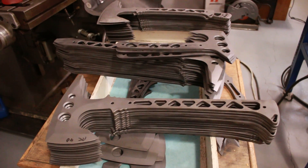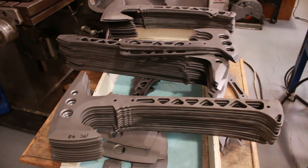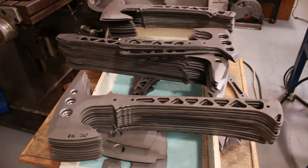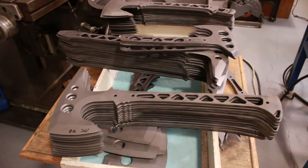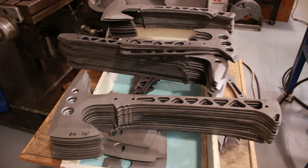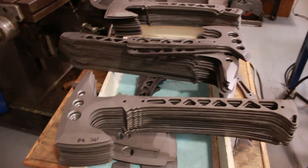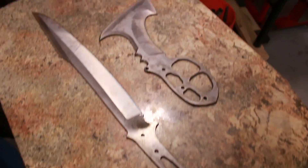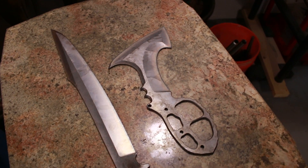These are tomahawks that were heat treated improperly twice, and tomorrow they're all going to go back to American Metal Treating to be annealed. Then I'm going to straighten them all again and have them re-tempered by American Metal Treating, because the sample batch that we had done, including these two pieces, turned out just right.